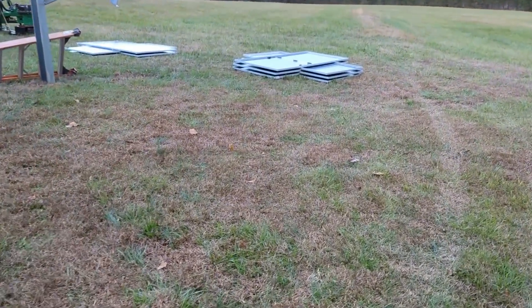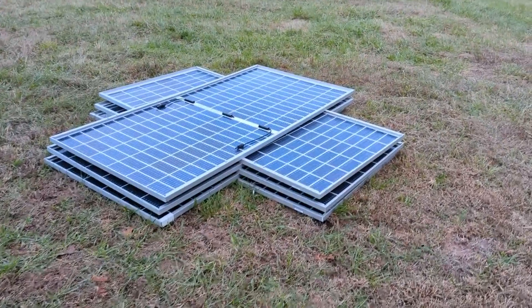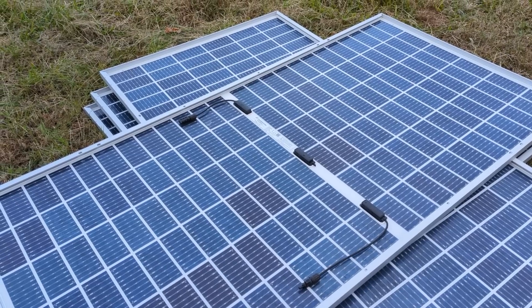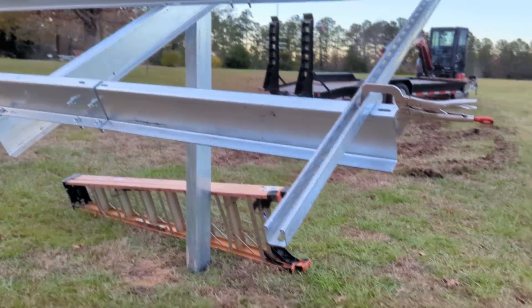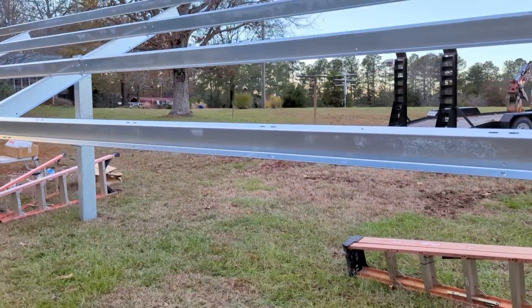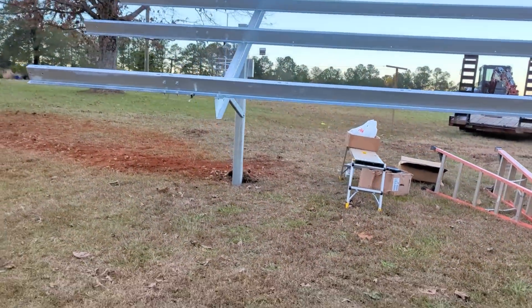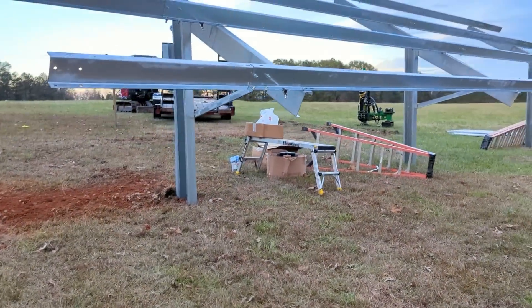With these Canadian Solar bifacials — the short jumpers won't reach the micro inverter. So now I've got potentially 48 jumpers to make tomorrow, which burns up endless MC4 connectors and time. That was bad planning on my part — I'm just not used to micro inverters. These jumpers are fantastic when you're just doing DC, but Enphase — that was an oversight on my part. If you don't do it every day you run into things that just bite you.